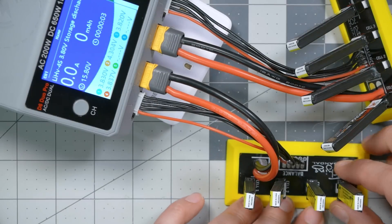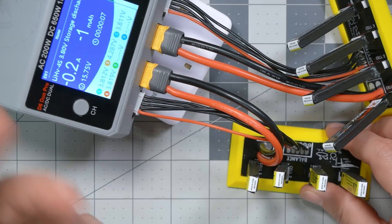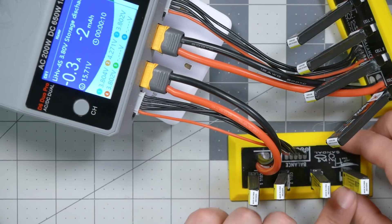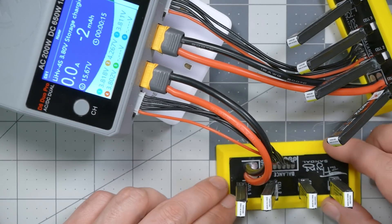But I still don't think it's going to work if you don't have all of the series connections plugged in. And indeed — it's not happy, because it sees that there are missing cells. So I'm just going to take two extra batteries already at storage voltage and use them as a placeholder. You've got to have the whole series board filled up for it to actually do anything. All of the slots on a series board have to be occupied. That's another difference between series and parallel.